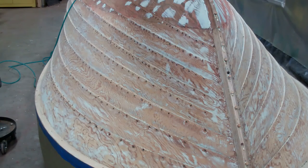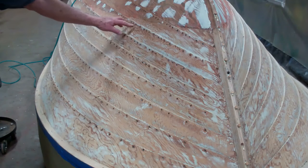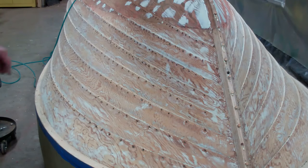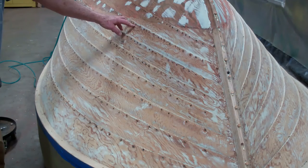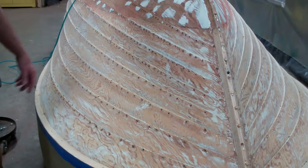This is helped by the fact that all of the intermediate fasteners — all of these between ribs — actually have machine threads and flat washers and nuts on the backside. So, unless they spin, I am able to tighten them from the outside, which is a great boon.